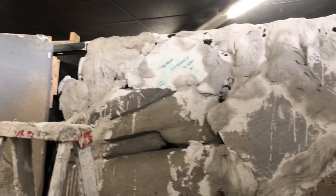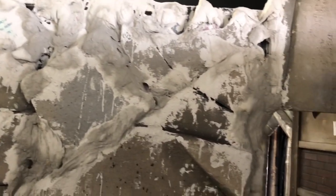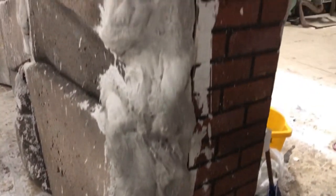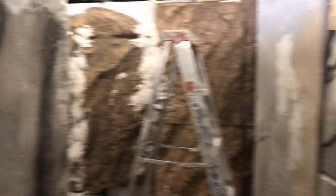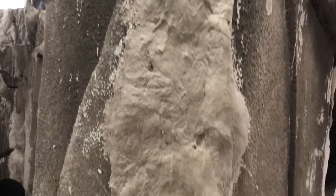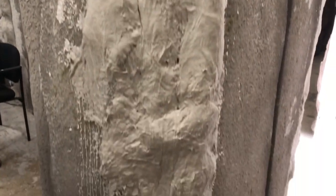We came along and put some foam in certain areas, and then we used the Durabond around it, like in this area here and here. Just kind of blend it in. That's going to look great once it's Durabond. These are the thermoform panels, and I just kind of blend those in. Some of them had little sharp edges on it, so we just smoothed those bad boys in. This right here was cut off, so the wood was exposed from the framing, and so we just cleaned that up.